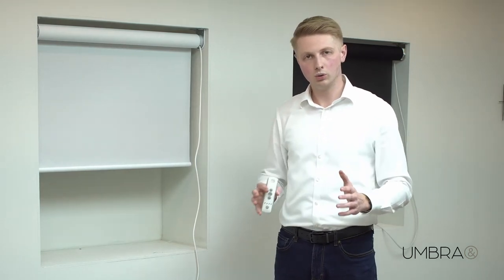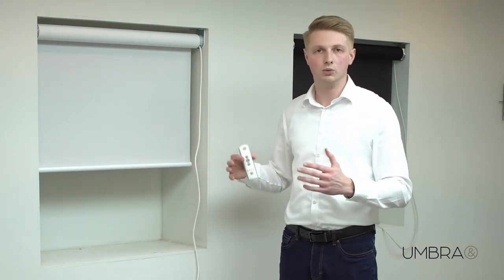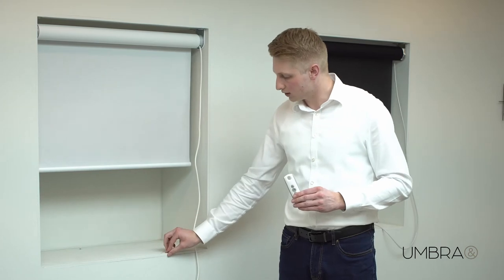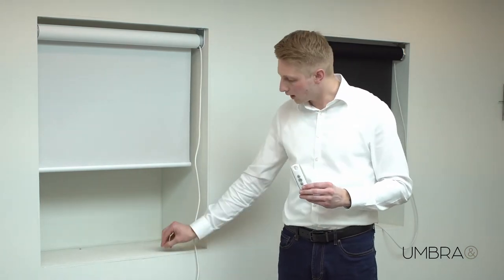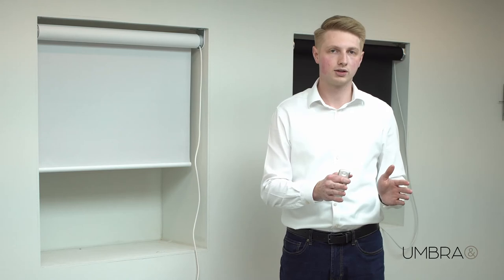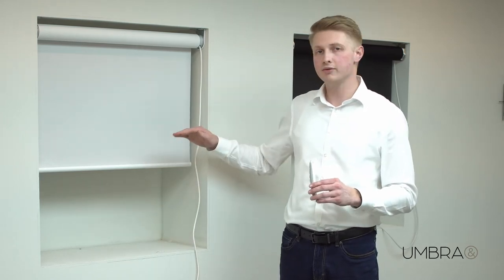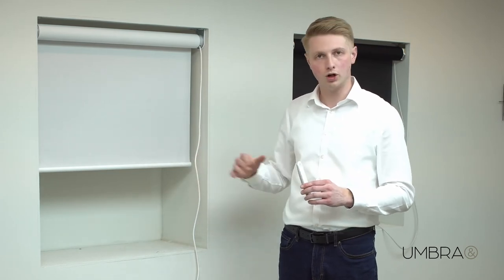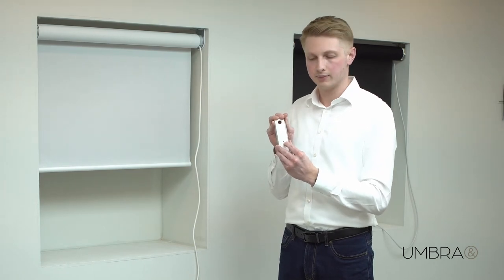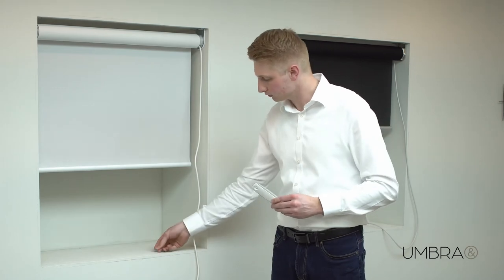Now, what happens if you've done all of that and you've made a mistake, or you want to change those limits, or you want to completely wipe the motor and use it perhaps in another blind? For this, you'll need a paper clip or a ballpoint pen. It's also very handy to be able to turn the power on and off easily and quickly. You do a complete factory reset by turning the power on and off in a sequence: start with the power on, turn it off for four seconds, on for eight seconds, off for four seconds. At that point, the blind is going to travel for five seconds in the opposite direction to the way it last travelled. Then it will stop. Once it's stopped, press and hold the programming button until you get two shunts from the blind.